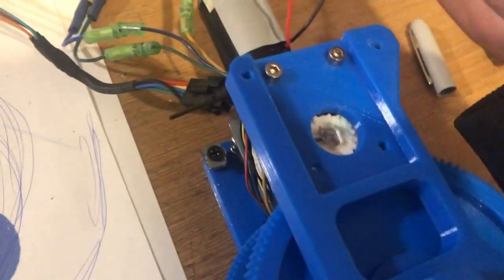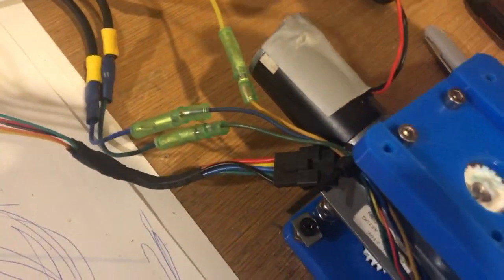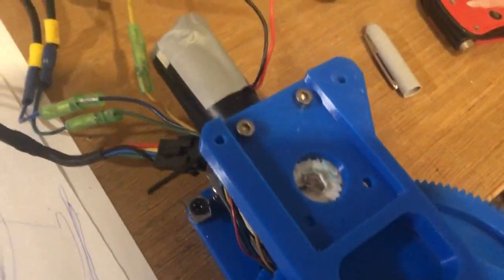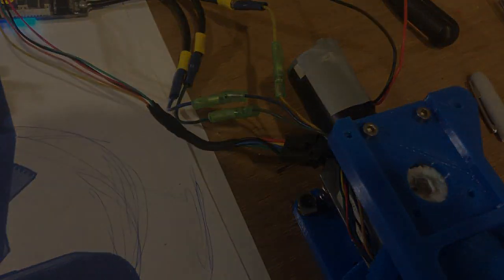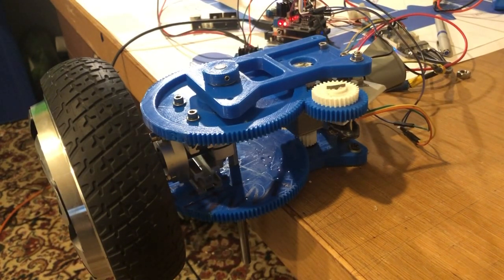The motor I use for steering worked fine, but when I went to test it again with longer wires it stopped working. I thought I might have connected a 12V motor to a 24V battery and fried it. But it turns out the battery was only 14.4V — no problem there. I traced back the wires, found a split in the wire, cut it, stripped it, and reconnected it.